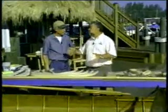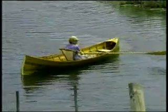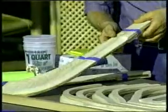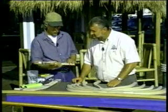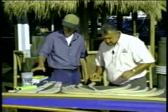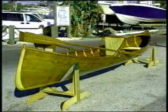You guys are building a beautiful boat — it's literally like a piece of art out on the water. And I got real excited when I found out that you also make kits. What are some of the components made out of? Well, John, this is a very comprehensive kit, and it's made so that people at home can build this boat, yet it's not so intimidating that they don't get the project finished. Here I've got a stem — you can see it's already been rabbited, so a lot of the work has been done for you; it's really just an assembly process. The stem band is on there, all of the brass pieces. Moving down here, we have the ribs — there are 13 ribs to each boat. These are the strips, John — they're made of western red cedar, and they're very lightweight and very durable.